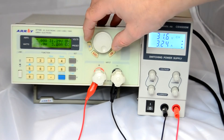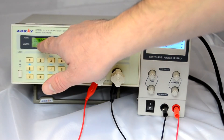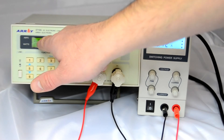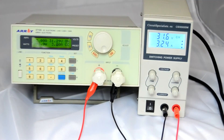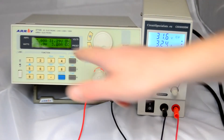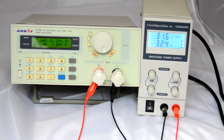At 3 amps there's another relay click — we lose a digit of precision, down to 2 digits. That makes sense: when measuring 360 volts you don't need 3 digits of precision, whereas at 1.2V FPGA core voltage you'd want it to be very precise. We're drawing 3 amps at 31V — that's 93 watts from a 90-watt power supply. Actually exceeding its maximum. Pushing to 97 watts, then 100 watts — something trips out. Dropping back down and switching the output back on: it holds at 100 watts straight away.